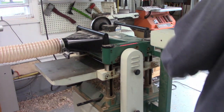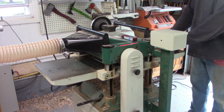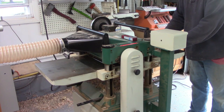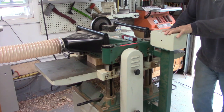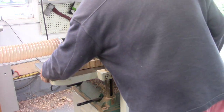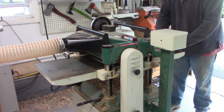Now I'm going over to the planer to make the back of the keyboard, the cherry portion of it, a little thinner. And yes, you can run an end grain cutting board through a planer, but you've got to do it in very small passes. And I had about three or four extra pieces of cherry on the end of this because the back end of the board will get chipped out by doing this method, but it saves you a ton of time with sanding.